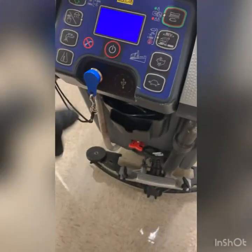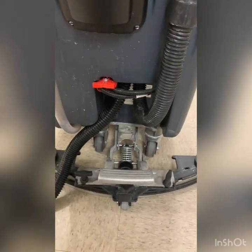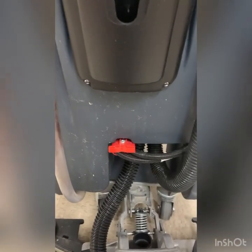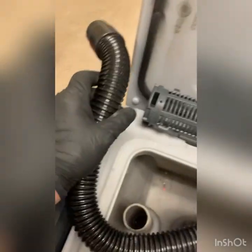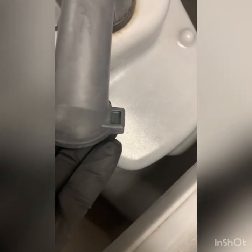I'm going to turn it back on again and check also to see if there's any breach in the hose. I'm going to take a look in here — there's some debris, but it's to be expected. Well, that's not very good water lift from the hose. I feel there could be something impeding it. So let's go up and I'll come back. I ran a broom handle all the way up and was able to see the tip, which means this section is clear. There is good suction, but it's very, very faint.